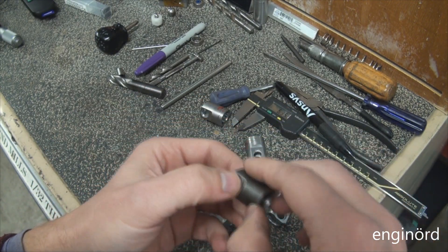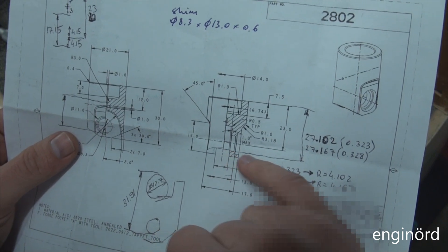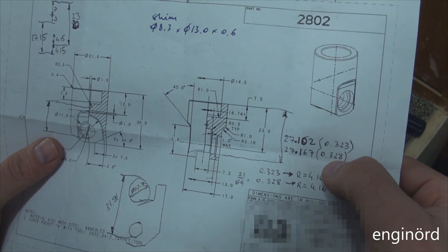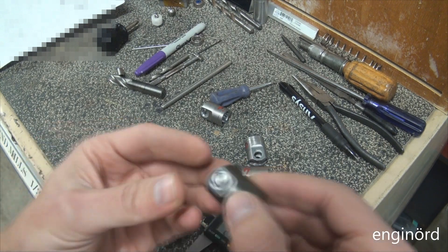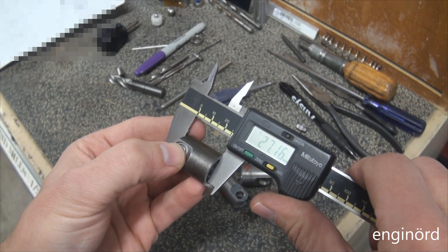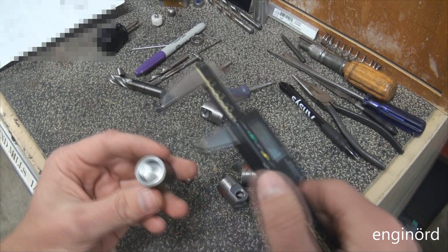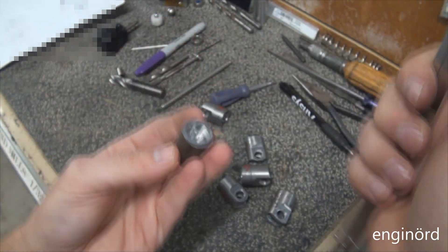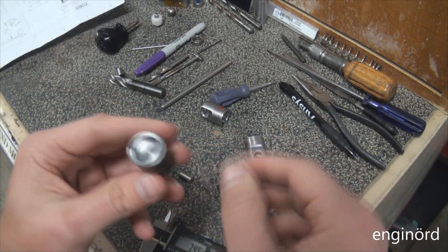Now a couple of measurements. I need to measure the length from this bore - the length from the bore to the top has to be 27.167, and that's with a 0.328 pin which is at 21/64. You can see the pin is inserted and I'm measuring across just like the print says, coming out at 27.16. The internal bore should be 16 millimeters, and you can see it's spot on. The depth should be seven and a half, and that is with the burrs - so I think that's pretty good.